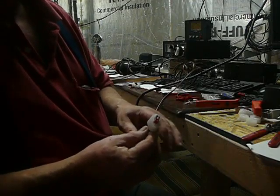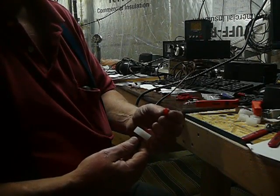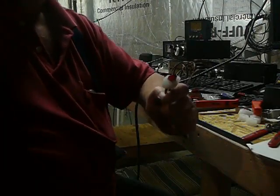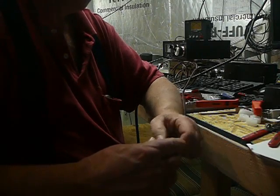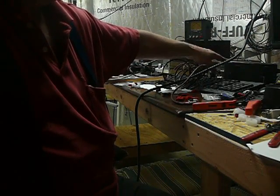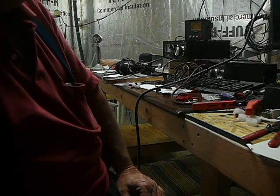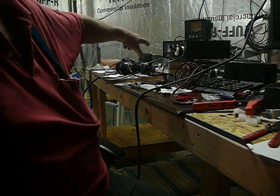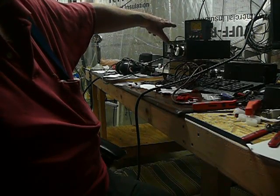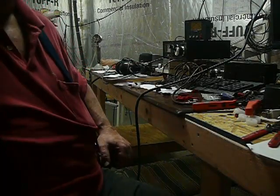They're non-gender specific, so they plug in — the red and the black you want on the right side, but really they'll plug into anything that's the same size. So there you are — those are the power poles inside the power pole grippers. I'm using them for my 2-meter radio. I use power poles on my HF radio too, but they're thicker so I use the bigger ones, the 30 amp. I have a couple other things that I get 12 volts to — lamps, the 2-meter, the watt meter on the tuner, a standalone watt/SWR meter, my 2-meter radio, and my antenna analyzer.